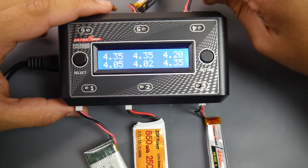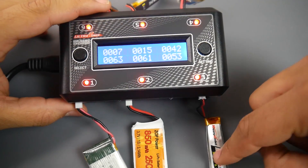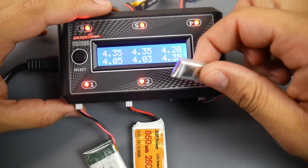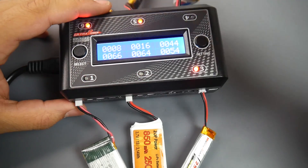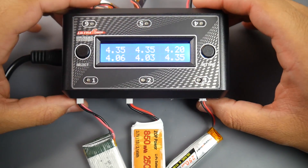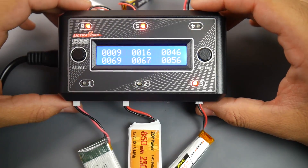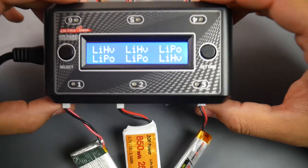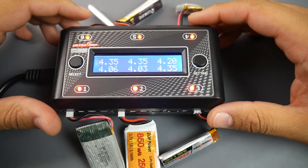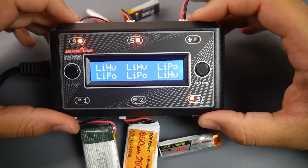The other batteries are still charging at 1 amp each and nothing is getting hot, which is great. That said, I don't recommend charging at 1 amp with these little batteries — try to stick to 2C maximum. So if it's a 250mAh battery, you can get away with 500 milliamps. I'm currently charging at 4C and it's not getting warm, but it's your decision. Overall it's a nice little charger, very easy to use. I'll do an update video after using it more. Hope you enjoyed — link is down below, see you in the next one!